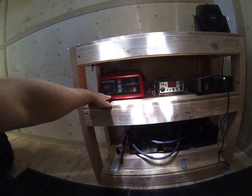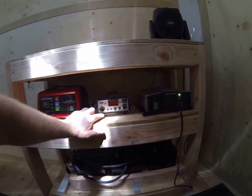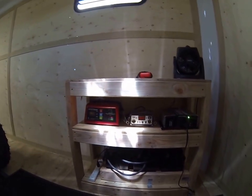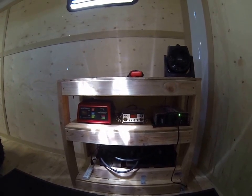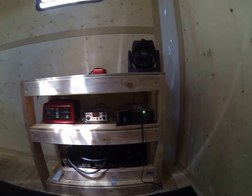Alongside I've got a standard 110V to 12-volt charger, so if I need to charge the batteries up at home, that works. This is the solar controller — I've got three solar panels that I'll put up outside. They're just portable, they go outside with about 50 feet of cord, and I can charge the batteries with that as well.